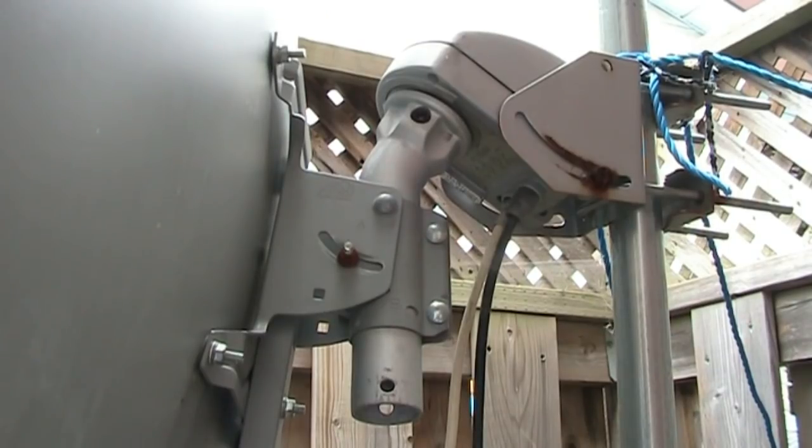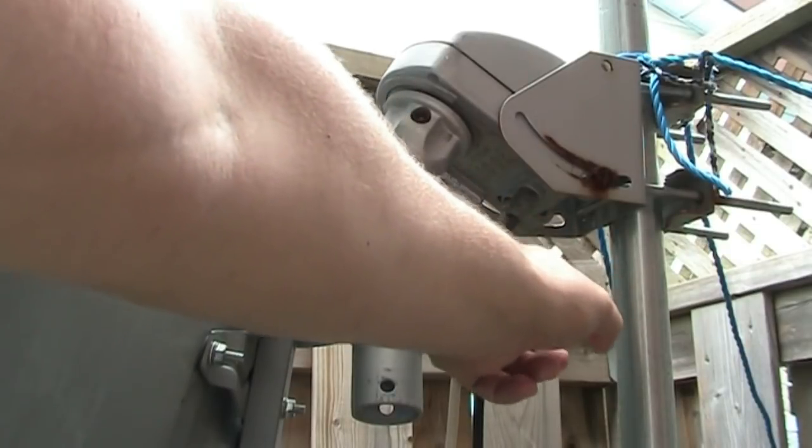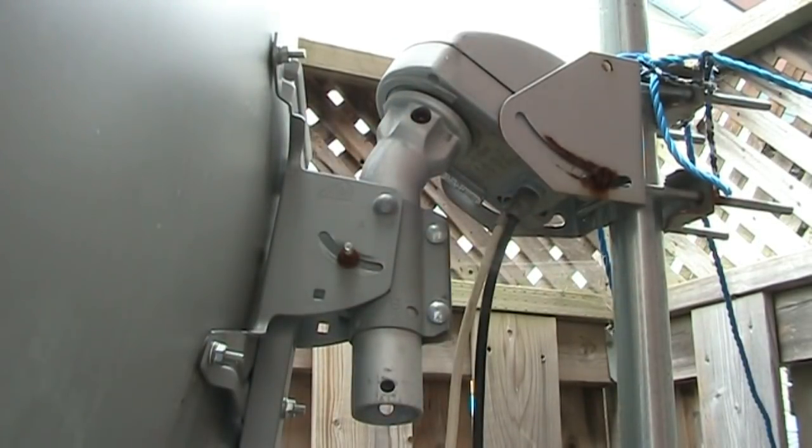This is simply a motor that connects to the dish. It will move along the arc east and west, and it just has a regular piece of coaxial cable going up and down from the receiver. The great thing about this is you don't need an extra motor driver or anything — it all works with one receiver, this motor, and the LNB for the dish.